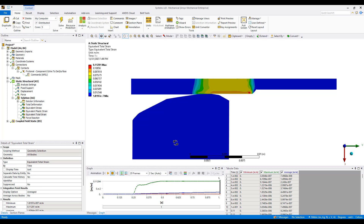An additional concern as wires deform this way is that you could have temperature issues. There's a lot of friction going on at the interface, and there's significant metal deformation — permanent plastic deformation — which could generate heat.